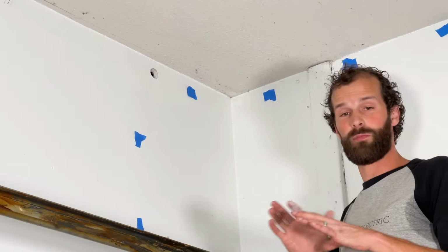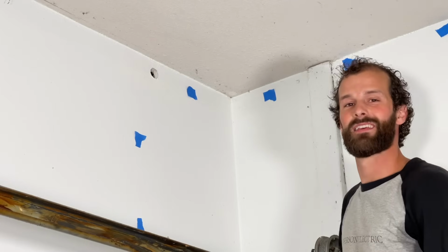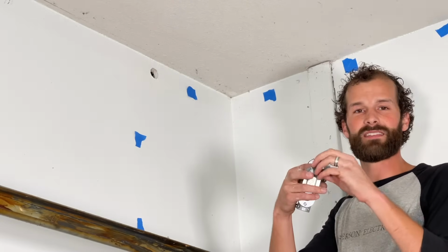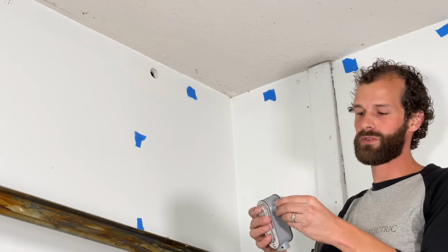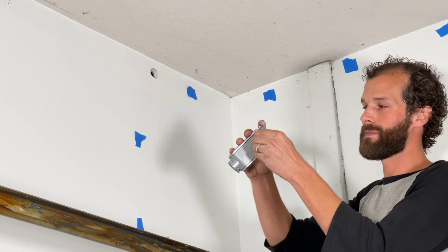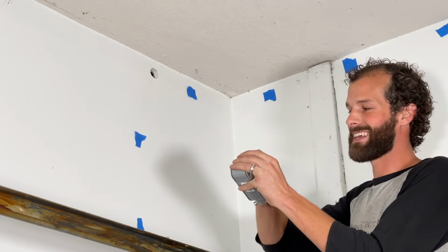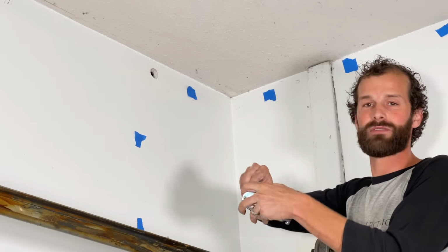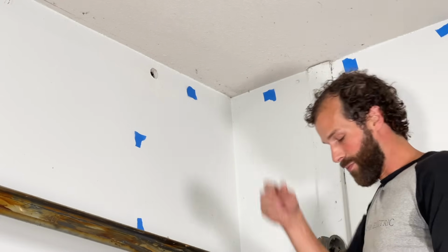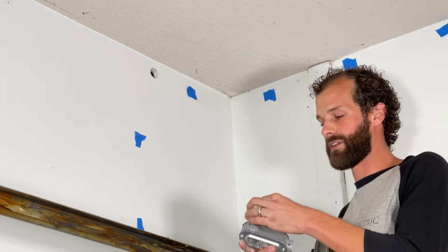All right, now before pulling any wire, I generally complete my conduit system. Let me show you a couple things. One is this little gem that didn't get called out in the parts list. And what this is, is a chase nipple. This is going to smooth the threaded edge of my conduit body. I'm just gonna put it right in there so that when my wiring is exiting the conduit body, it has a smooth exit, because houses do vibrate, and believe it or not, something that's been fine for a long, long time can go bad in the dead of night. So that is code, to protect wiring during the installation.